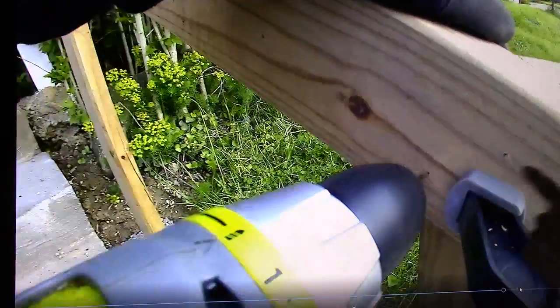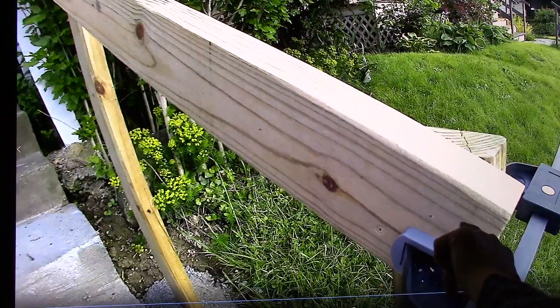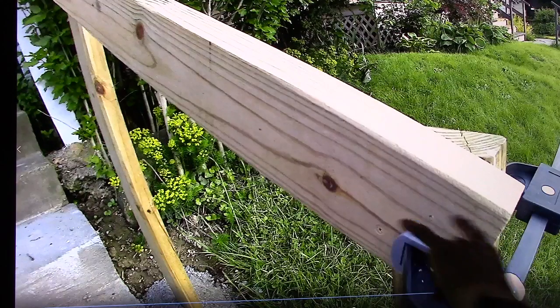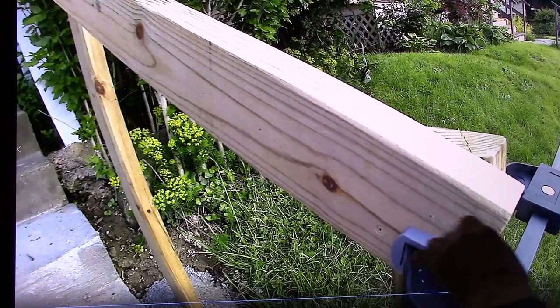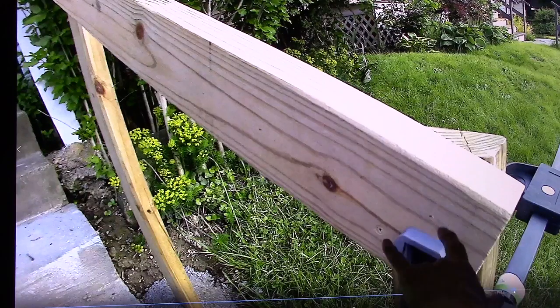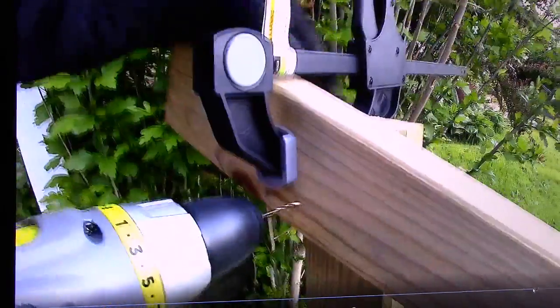You'll notice I did the screws offset. I did this because there's one grain of wood going this way and one going that way. If it splits, the other screw isn't affected. If I did them top-bottom on the same line, a split could cover both screws. With the offset pattern there's a redundancy. The same applies to the post — the grain runs up and down. You're distributing the stress, so there's not as much stress on one section of fiber in the wood. This is pure physics, basically engineering — not decorative.